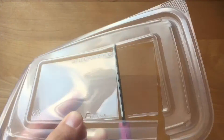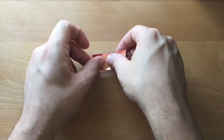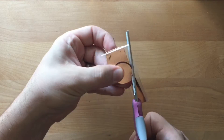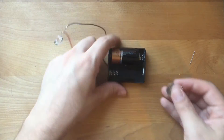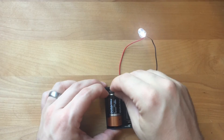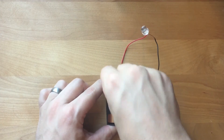The first thing I'm going to do is cut out a piece of plastic, then add copper tape to both sides of the plastic. Now I'm going to cut it into the shape and size that I want, so I don't need to separately cut out three identical layers. The battery interrupter I'm making is suitable for C or D batteries. If you need smaller batteries, just make a smaller circle — it's more about getting it to fit inside the case without shifting around. Now that we have our sandwich, I'm going to test it to show that it's cutting the power by sliding it into this battery case to cut power to this LED. Now we know it works, so let's add the leads.